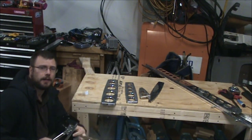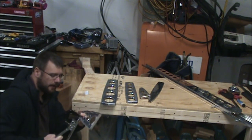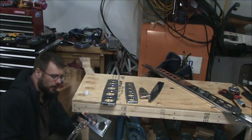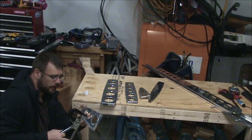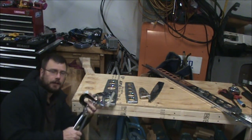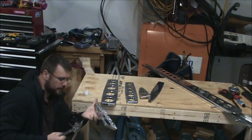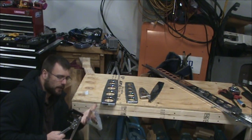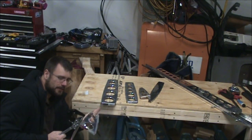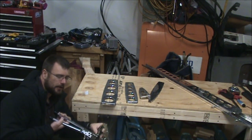And then I like to basically screw these together to where they're supposed to be, and then screw the adjustment out another half a turn to make sure I'm not under dimpling. And then if you notice, every time I squeeze, I check the dimple that I just formed, but I'm also making sure that I'm skipping the holes that I need to skip. Because that would be the worst thing to do at this point, is dimple the wrong hole.